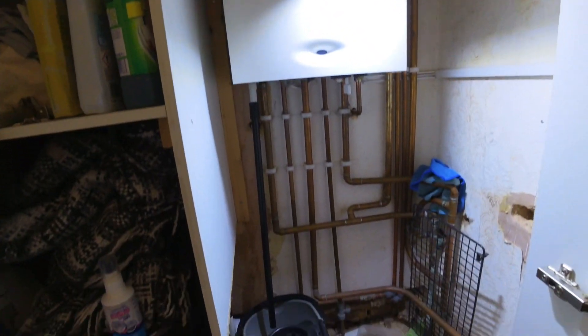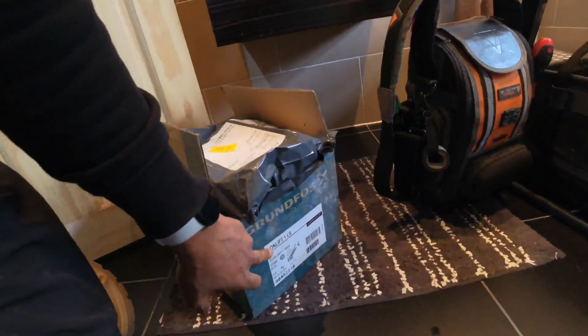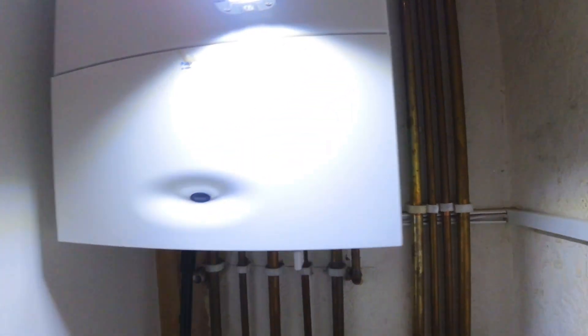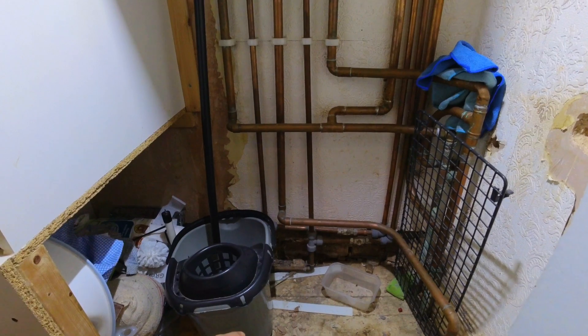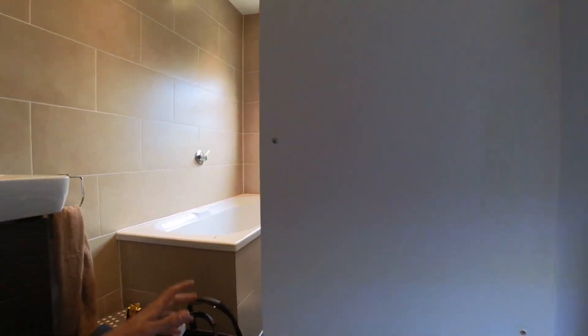Today's video is back at this job for the third time, and it's going to be on fitting a condensate pump — specifically how to install a condensate pump to this Worcester boiler. We've got a ConLift 1LS. The reason we're fitting a condensate pump is because there isn't anywhere low level to run the condensate. The external wall starts about here, so at the moment the condensate and the PRV are going into the wall and we can't see where it's going. The customer has had some problems with leaks coming from the kitchen downstairs when the boiler's been running, so we're suspecting there's probably a break in the pipe somewhere. There isn't anywhere to run the waste on this side because it's all on the other side of the bathroom.